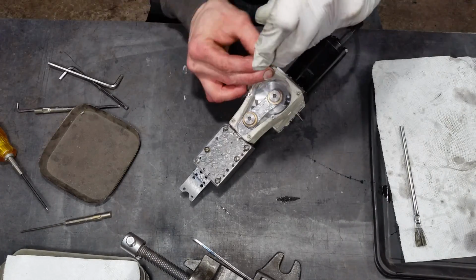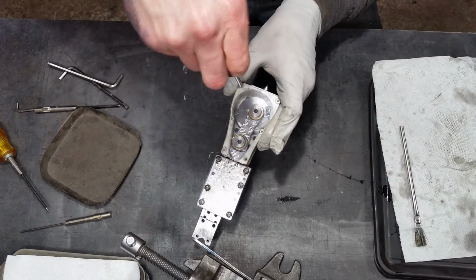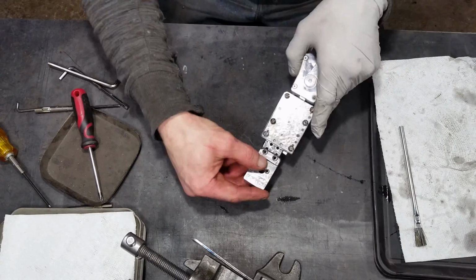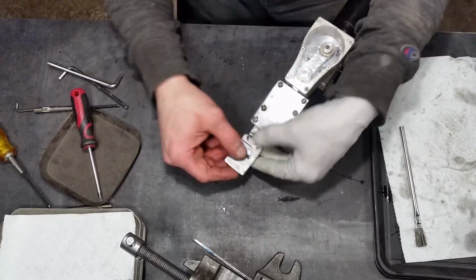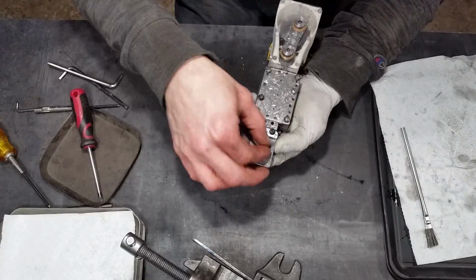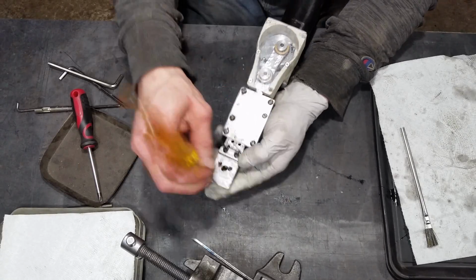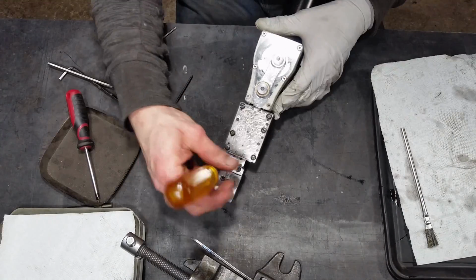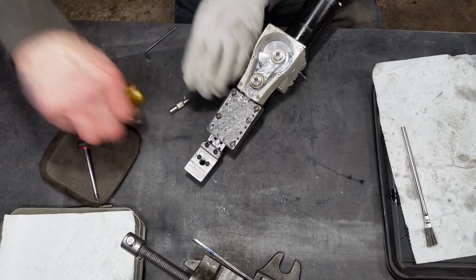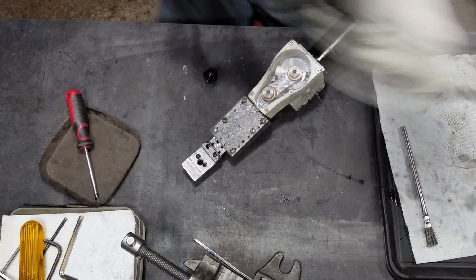Now we're installing the Lexan cover. Just made it clear so that I can see it for access to oil and to adjust my stroke length there. Now we're installing the foot, which I've modified to round over a lot of those edges to eliminate some of the pinch points that have been in there. There's a couple 6-32s that are pocketed in the front there that hold it on, and then a couple 8-32s in the back, and it's also pressed up against the edge.